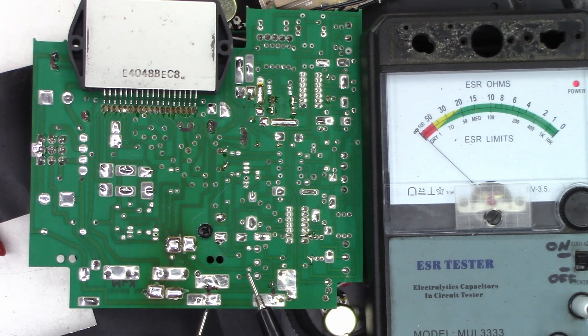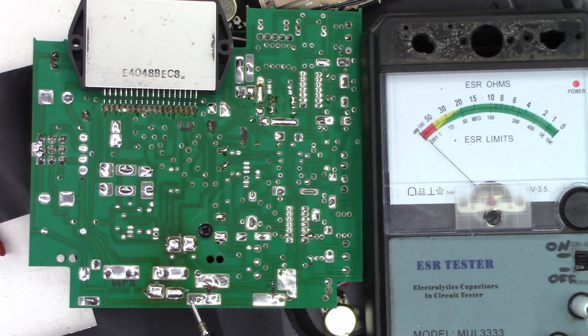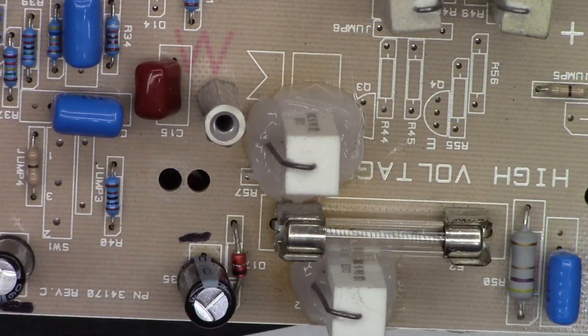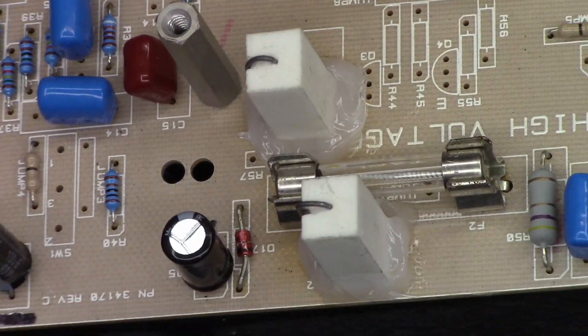The problem was these caps — especially this one that measured almost 30 ohms. That is the filter capacitor after the dropping resistors. Remember on the other MK subwoofer these were broken off of the board? Well, this appears to be a later version — it has much larger pads on the circuit board for these large resistors. I went ahead and resoldered them anyway — they're absolutely perfect. I'll add some silicone to those resistors just to make sure they're tacked down to the board securely as well. I've got the power resistors secured to the board with some silicone RTV — it can definitely handle the heat these things are going to generate with no problem.